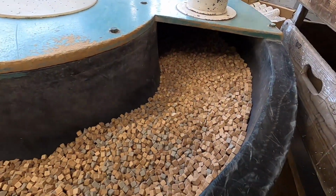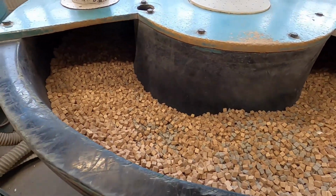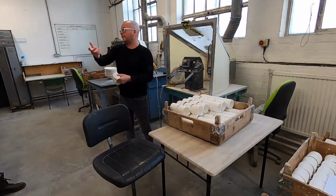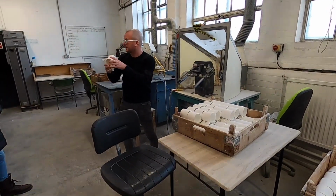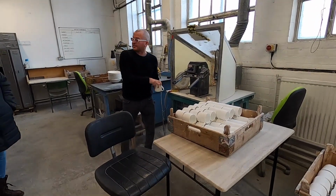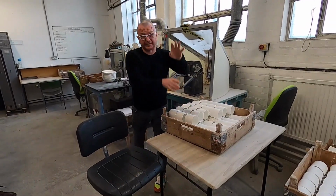Last stage, people are all very fascinated by this. What we're doing here is selecting: coming off the kiln, selected, through the vibro, selected, into here, selected. So all these sets of hands, all these eyes are looking over stuff. And these guys basically look for any impurities, and they'll polish and grind it away. Then, once that's done, you get to go into that room there.